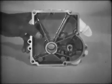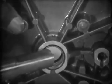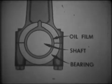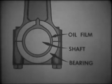When working with bearings, always keep in mind that there must be a space between the shaft and bearing metal for a thin film of oil. Because of the oil film, the steel shaft journal never actually touches the bearing metal. Without the oil film, the bearing would be ruined in a very short time. The acceptable measurement readings for these parts are found in the manufacturer's service manual.